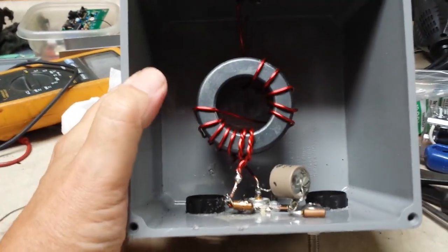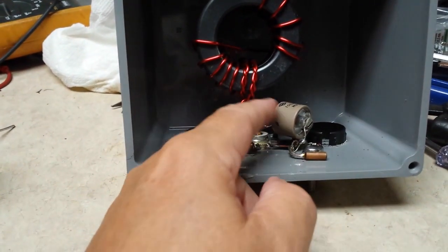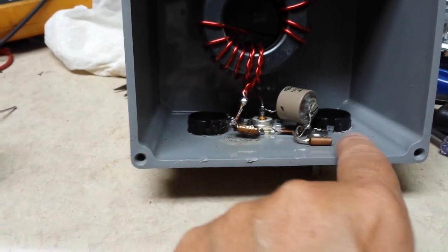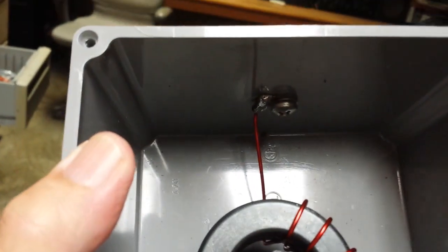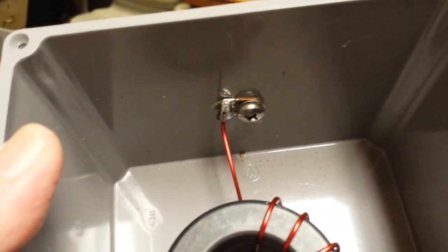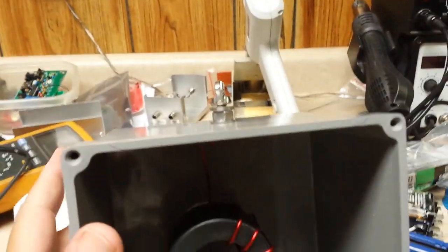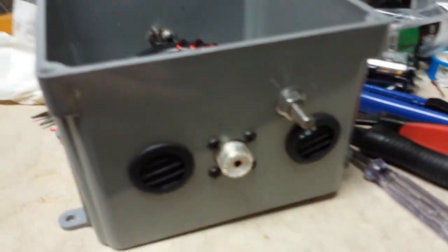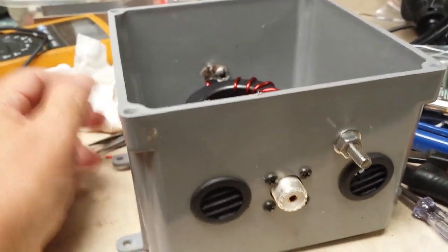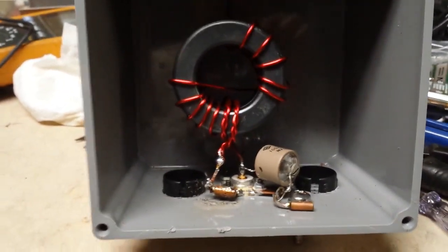Alright, we're all done — got it back in the box. Got our ground lead here, and the hot one back in. The capacitor goes from the hot center of the SO239 to our ground. Our antenna wire goes straight up. We've got a tooth washer under the head of that screw to help make contact. Got all quarter-inch hardware — one-quarter-inch. It's just easier for me, nice and big, and everybody's got a quarter-inch drill, and you can make real good connections to it.